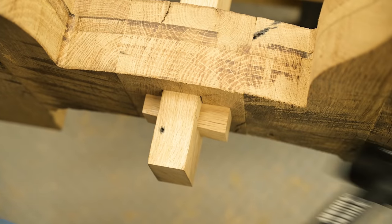So with sanding this, discovered a few things. I was hoping to get through all the mold, didn't, that's okay. And also when we were dusting it off and sanding, some of these boards just have some really loose, soft stuff. I think these top planks are actually fir or spruce or something. But anyway, to deal with the mold, I've just got some alcohol diluted with a little bit of water. We'll spray that on, that'll kill it. And then the next step after that is going to be a penetrating epoxy over the whole thing, that'll firm up all the wood, so it'll make a good surface.